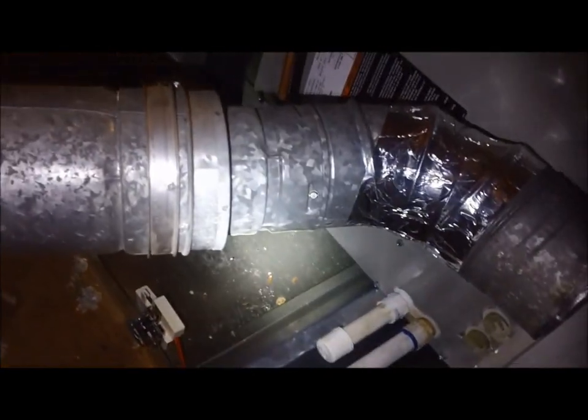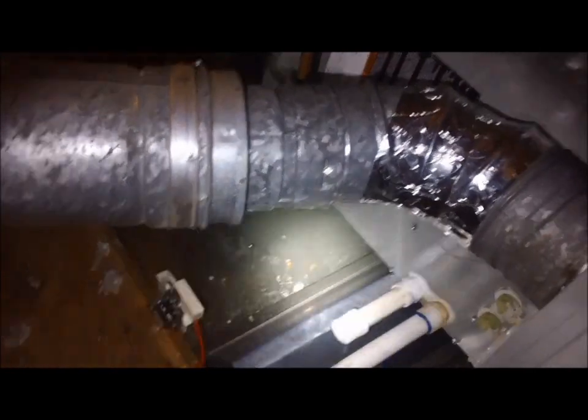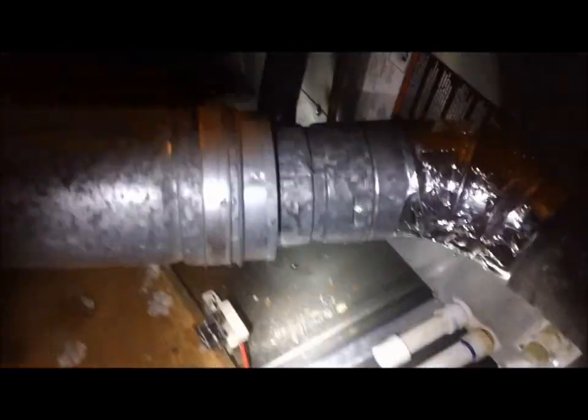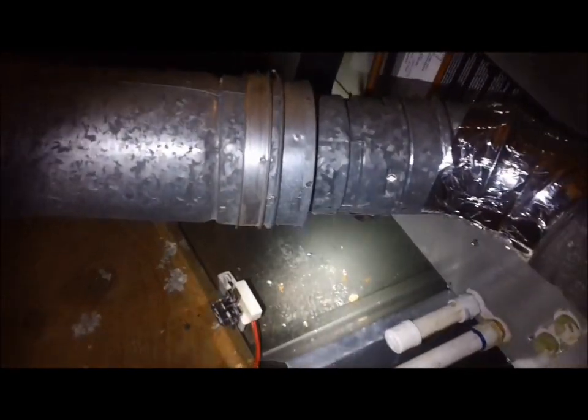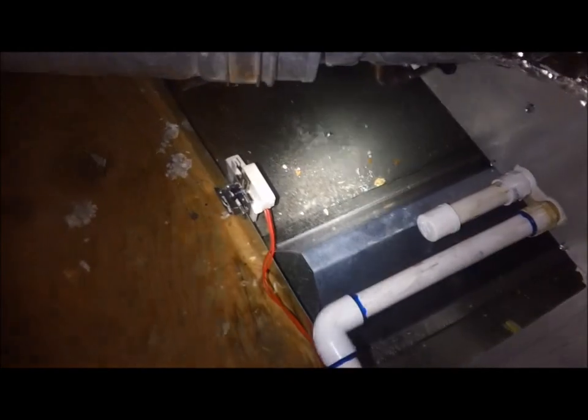This is the one I was telling you about, Zach - this is the customer that never had an emergency drain pan. This is the one where all his equipment was sitting on the platform - wasn't on furnace stands like we did here. This is the customer whose ceiling flooded. What we did: we picked everything up on furnace stands and got an emergency drain pan under here with a float switch and did it the right way.